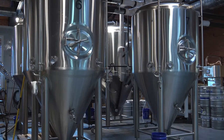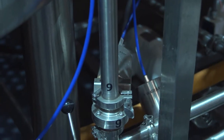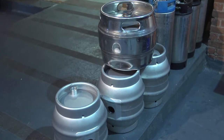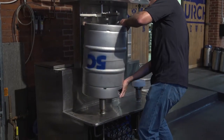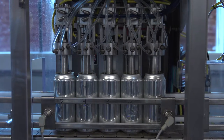What we first have to look at is what is actually run by compressed air in your craft brewery. We start out of the gate with the brew house itself, which has a lot of pneumatic controls — control devices to bring the different hops, barleys, and water in. The second part is after we brew the beer, we have to do something with it. Most people put it into a keg. Keg washers are the biggest thing — we have to sterilize those kegs. We also look at canning or bottling, which is another big air user.